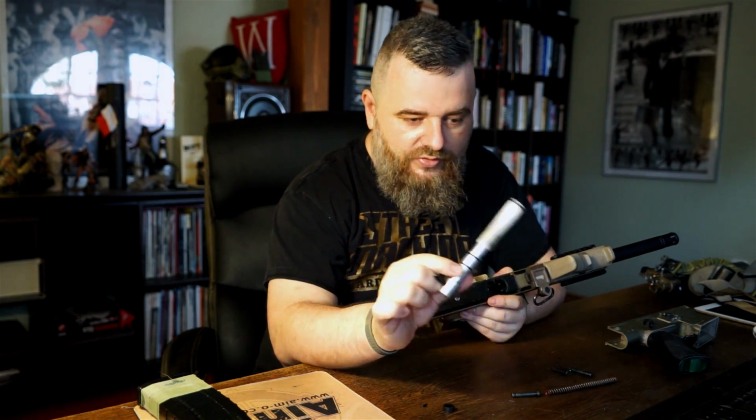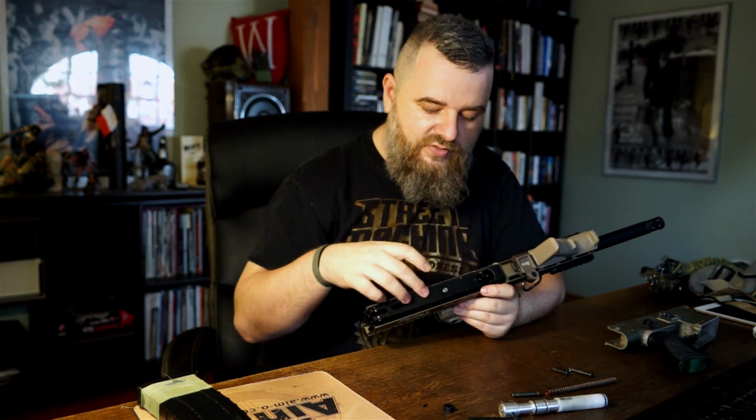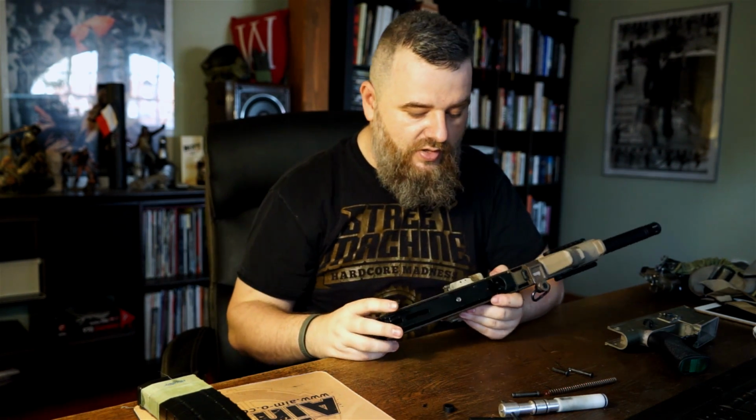The O-rings on the bolt are just to make it a little bit more efficient. It cannot leak through the bolt. I guess it cannot leak through the hammer, so every time it leaks, it's here, and you need to replace the O-rings here or on the air block. And basically that's the only maintenance you will get.